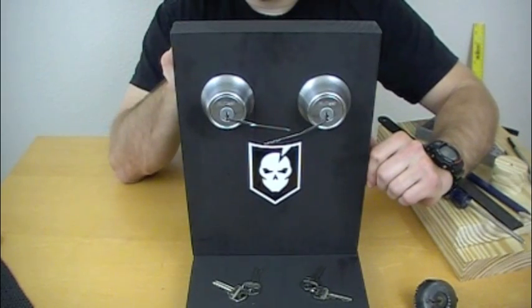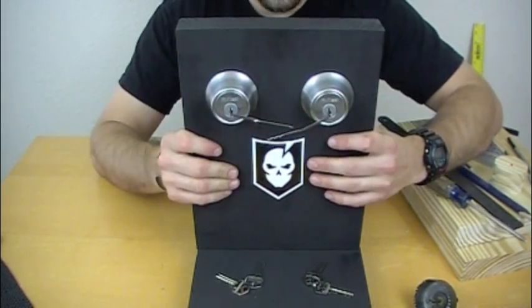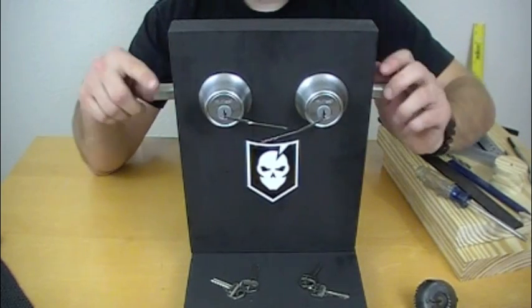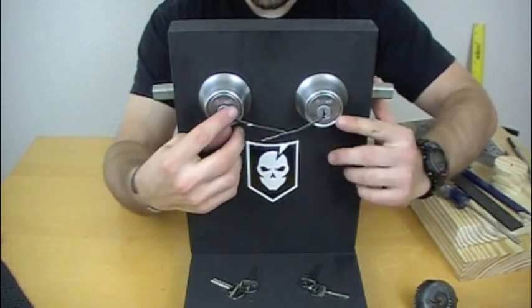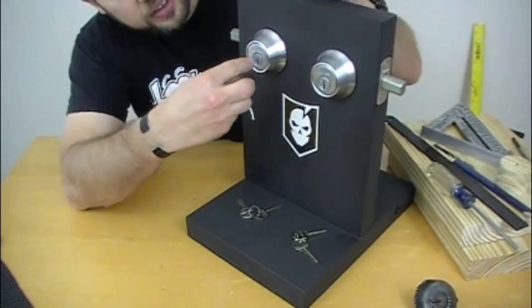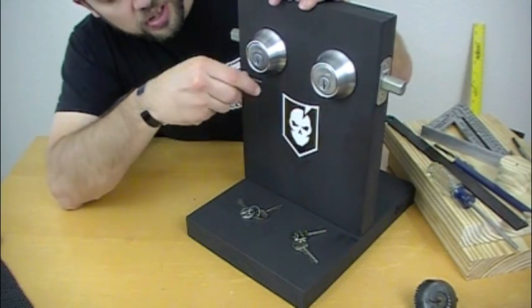Hinges on the right side of the door, it's going to be this arrangement. You look for where the hinges are on the door, you look for where the lock is on the door, and those are your big visual cues to which way you need to turn. Just looking at a lock doesn't really tell you much, because I can take tension on this lock either clockwise or counterclockwise and it doesn't budge either way.